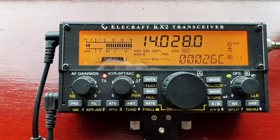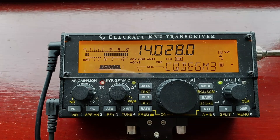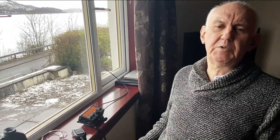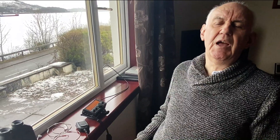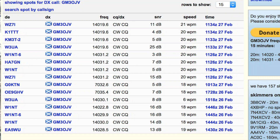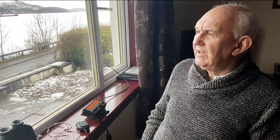I'll show you how I pre-programmed it into my KX2. Store that into your transceiver as a message, then press send and send it a couple of times. Then go into Reverse Beacon, select spot search, and type in your call sign. So if I type in GM3OJV, up on the screen comes this as you can see. You can see that there are quite a few stateside beacons that have spotted me, but not too much in the European direction — which really supports the fact that that mountain over there is acting as a reflector.